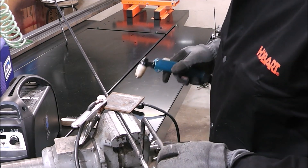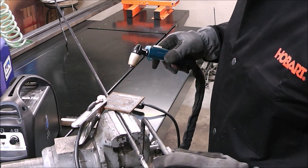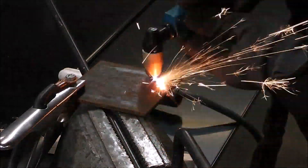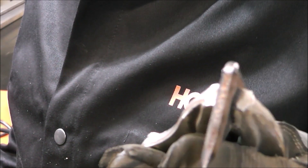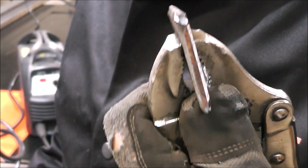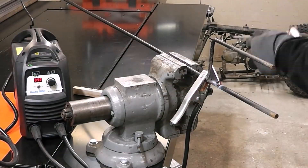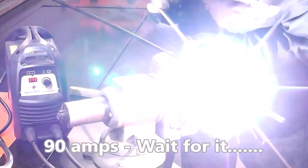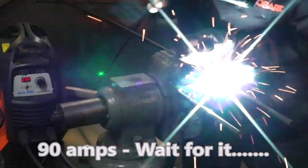Now I could cut this on my metal cutting chop saw, which we'll be using in a few minutes, but this is just as quick to do it this way and I don't have to mess with the backstop on the saw. If you're wondering about any of the tools I'm using, I'll put a link down in the description. You can see I've beveled it just like we did on the other pieces — that beveling just gives a place for the weld to go. This is my go-to stick welder. I just love the arc, I love how it re-strikes — it's buttery smooth — and it also does lift-start TIG. This is a lot of welder for not a lot of money. Running something at 90 amps continuously is different than just tacking it at 90 amps.